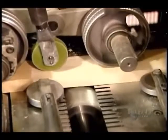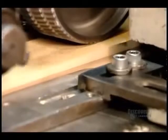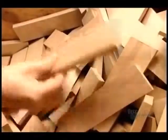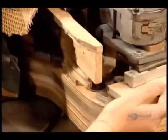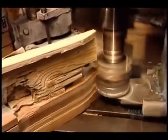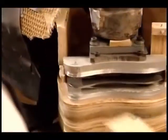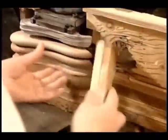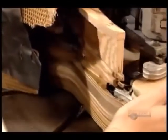The next step is called molding. A series of saws trims the blocks to the required thickness. Now they contour the pieces using a machine appropriately called a shaper. The machine revolves, running the block's outside edge against a cutting head. This profiles half the block. Workers then turn it around and line it up for a second pass to profile the other half.